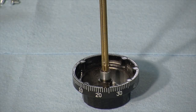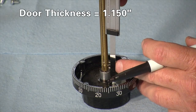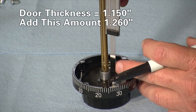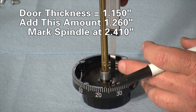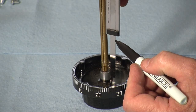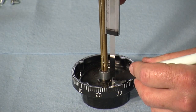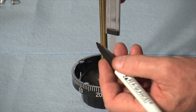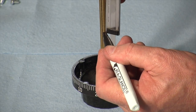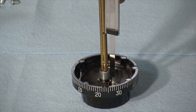Here's an alternate method for marking where we should cut our spindle. We measured our door thickness at 1.150 inches. To that dimension we add 1.26 inches — just a shade over 1.25 inches — and we get a total of 2.410 inches. I've extended the depth probe on my calipers to that amount. I place the end of the depth probe on the ridge near the base of the spindle hub and mark my cutting location on the spindle. If I cut here, my spindle length should be correct for this door.